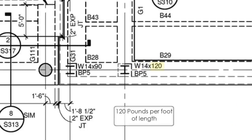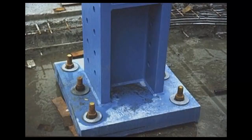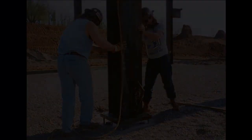The last number identifies the beam's weight per lineal foot. Now, regardless of the shape, each column will have a base plate, in some form or fashion, for attachment to the anchor bolts and connection points for the upper structural elements. During initial assembly, the columns are loosely attached on the anchor bolts to allow for easier assembly of the horizontal structural elements.